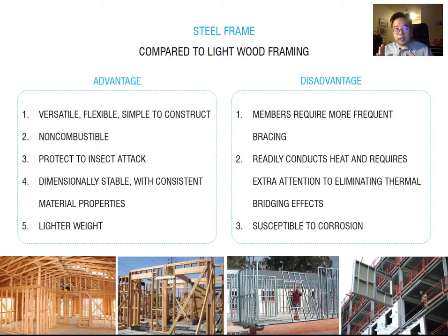Remember that metal is very thermally conductive. Through the wall without any protection, it loses heat energy very easily. That's why you need to design exterior rigid insulation to protect the thermal transition between outside and inside. Without exterior rigid insulation, you lose a lot of heat energy through the wall, because the metal stud is touching both the exterior finish wall and interior wall — it acts as a good conductor between outside and inside. You have to be very careful in this design.